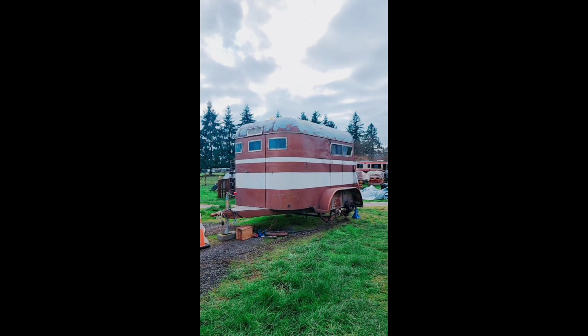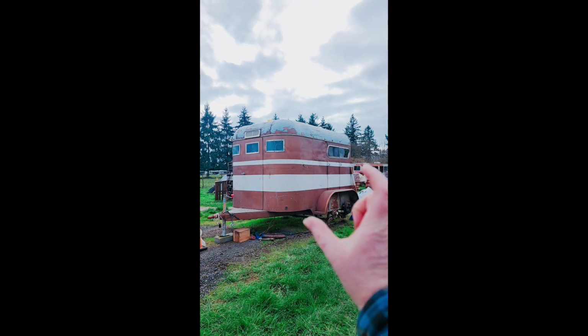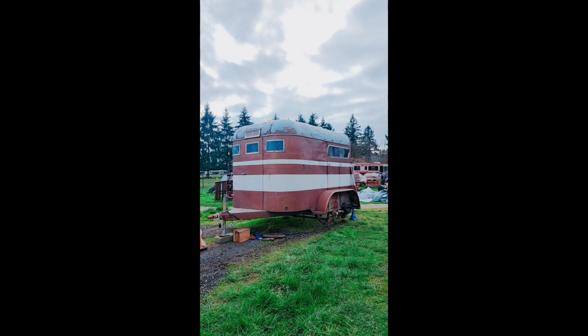And then I have patch that is specific for metal patching. Basically it's tape, but you can stick that to the bare metal and you can actually paint over the top of it. So it'll actually make everything look pretty close to seamless for wherever I have to put that tape on. All of the marker lights I've already removed, as you can see, but there's holes because these were so old that these were the aluminum body style. And they actually riveted them on, so there was no changing them out without drilling them out. So I'm hoping I can reuse those holes, but with the newer setups, they're a little bit bigger, and I'm probably going to have to patch those holes and put a rubber backing behind the plastic frame piece for the light itself so that it's got more coverage for waterproofing.